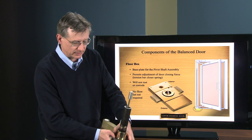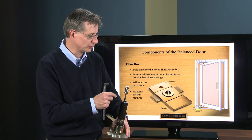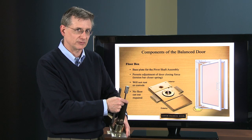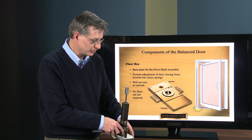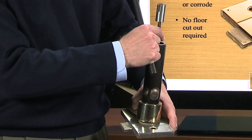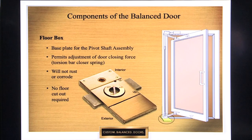Turning it around to show the interior side — that's how you impart the spring tension. You've got to wind this spring to give it the force to close the door. The real assembly goes up to the top six feet and is pinned in place right through the shaft, so it's fixed at the top. At the bottom it's allowed to move, and you adjust it by putting a half-inch wrench in and turning this gear toward the jamb. Every time you turn it, it torques the spring slightly, and that's what gives it the closing force.